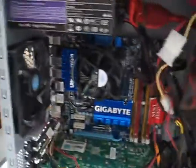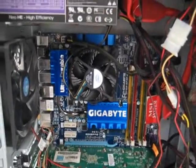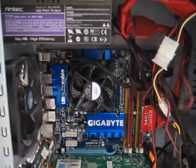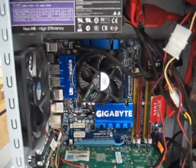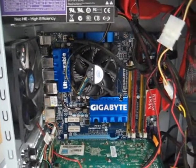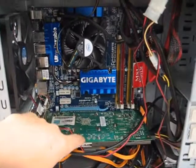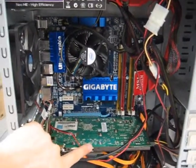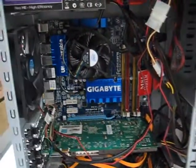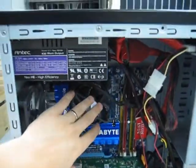With HD and video cards in Linux, it's important. So I started off with the basics of the board — it's a Gigabyte board that takes a Core 2 Duo. This is actually going to be the most powerful machine I've ever built for a home theater. The Core 2 Duo is clocked at about 2.6 GHz, which is a good clock speed for HD. I'd say don't go below 2 GHz — it gets really taxing on HD, especially if you're recording and watching at the same time. I'm going to be getting a NVIDIA 9500 GT, which has great Linux support, so a lot of the de-interlacing and decoding of HD content will be offloaded to the video card and not the processor.